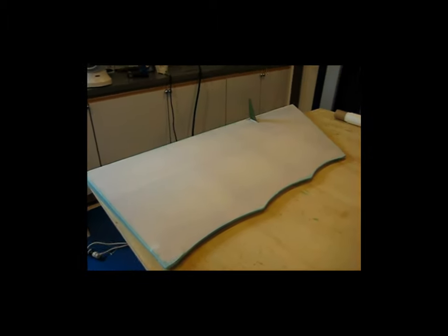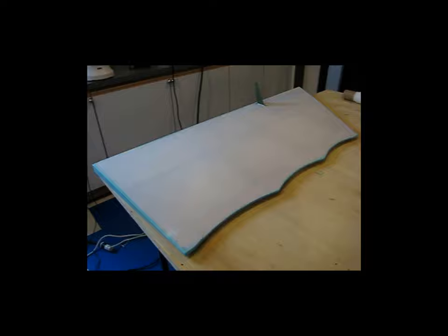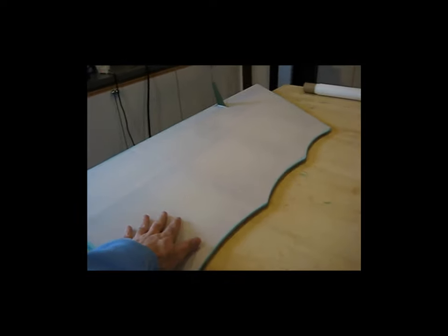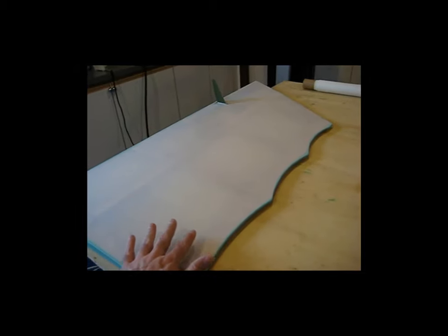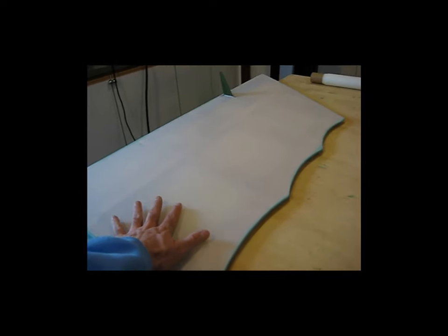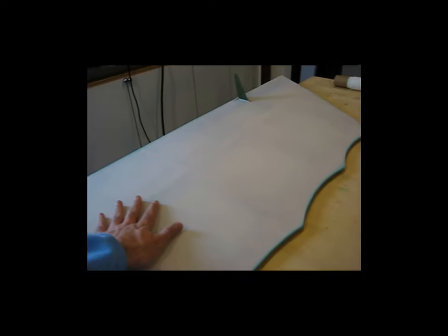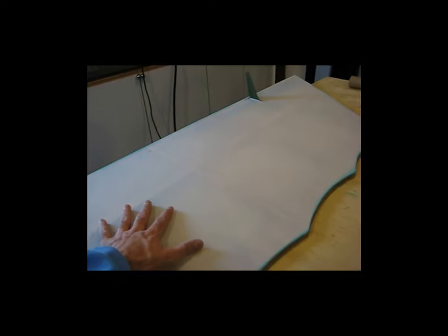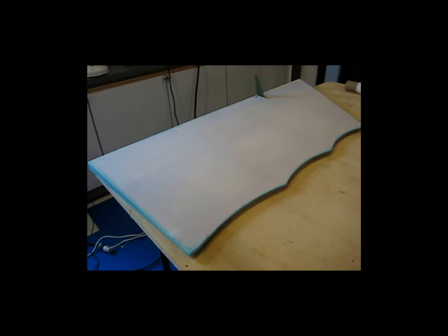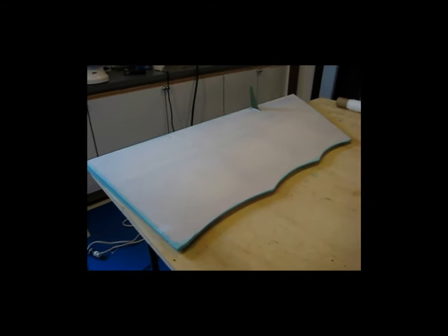There's the initial shrink on the first side of this elevator — this is roughly a 250 degree shrink. It's fairly tight, though not too tight by a long shot because there's no fabric on the other side yet, so you don't want to shrink this all the way because it may distort the piece. You want to shrink it enough just to get the fabric slightly snug and get the wrinkles out of it. Now I can flip it over and start on the second side with a new piece of fabric.